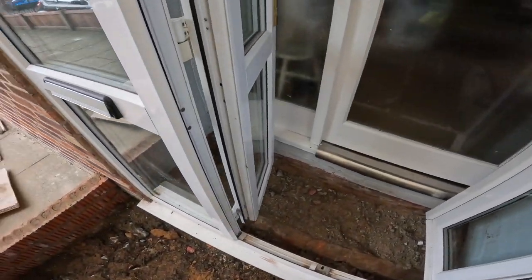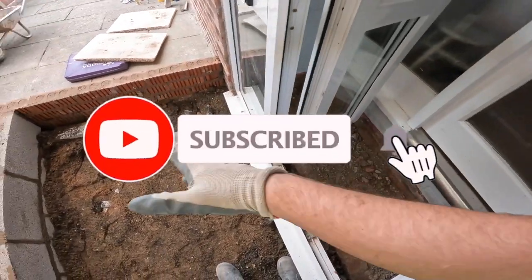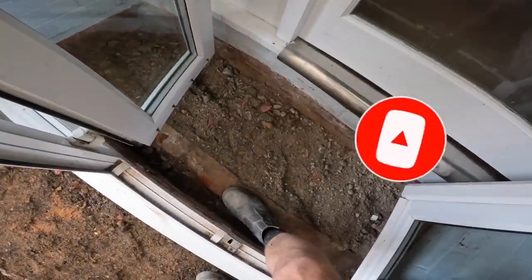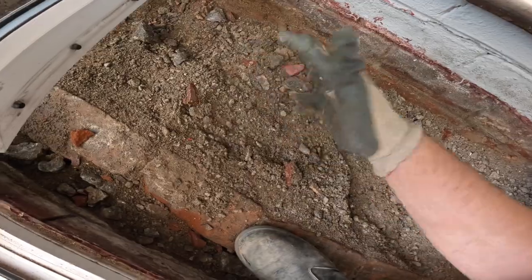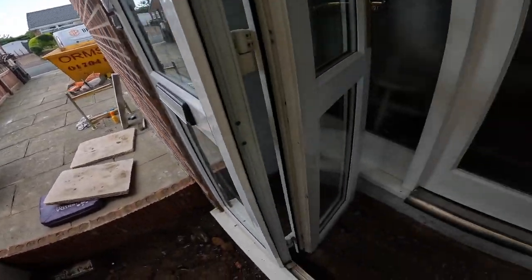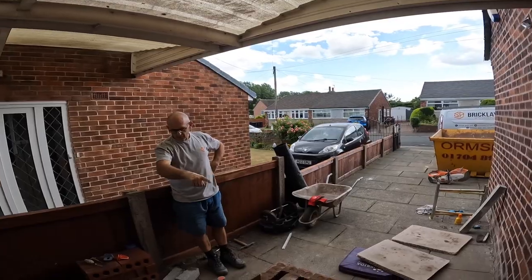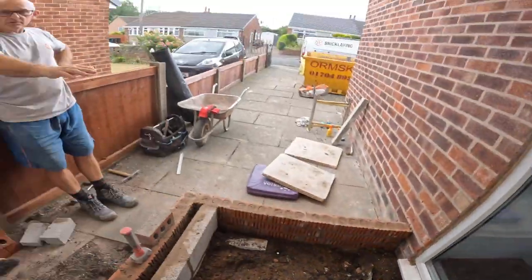Yeah. But there you go, so as Dad said before, that floor was terrible, so that's all been buried in here. Take a closer look, you can see the whole thing's damp. It's really wet, smells wet. That's got a good day and a half now to dry out before we go over the top of it. And then we're going to take the doors out, and when the doors come out, we're going to take that top closer brick out, and then our insulation can sail right through.